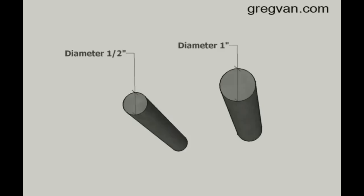That ought to give you a little help. They just go by eights — if you have a number eight rebar, that represents one inch. Half of that, half of eight, would be number four, which represents half of an inch. You can go in either direction and figure it out pretty safely. So if you don't know the diameter but you know the number, that should help you.